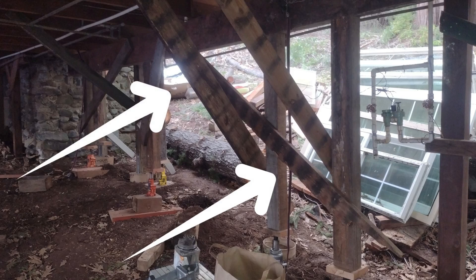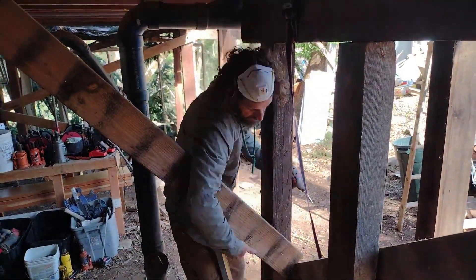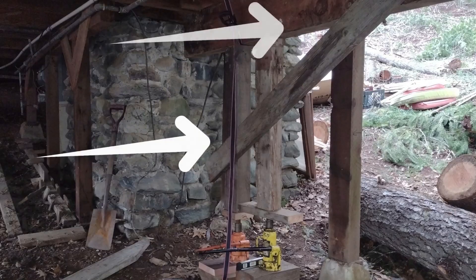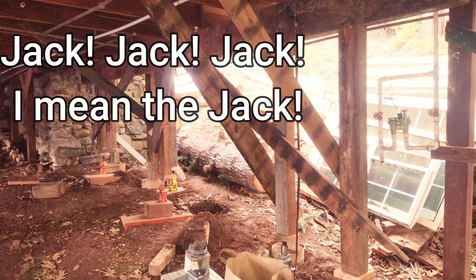So now you've got your jacks just snug to your posts. Before you jack up, when you're setting up your posts and have them all in place, the next thing you need to do is create lateral support — 45-degree braces in both directions. Take the post and secure it at a 45-degree angle to one of the joists above you. Level it side to side until it's perfectly level, then stick a lateral support scab piece — like a two by six — up to a joist in the floor, and do the same in the other direction to the beam.